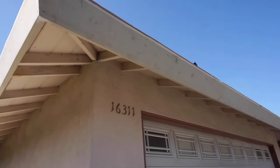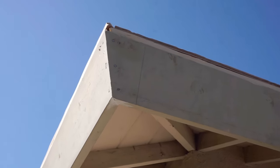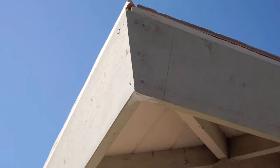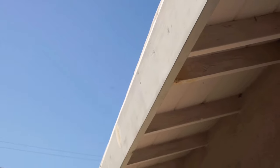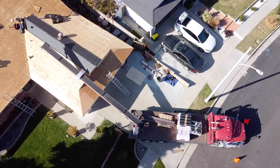Our woodwork is 100% completed. We went ahead and installed our new rafter tails, shiplap, fascia board, and then the plywood on top. As per California code, we install our fascia board with 16d galvanized nails.